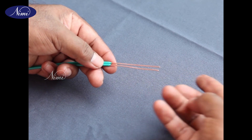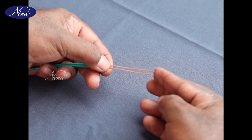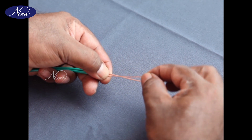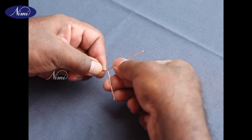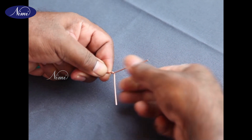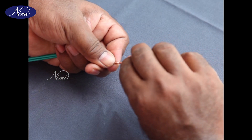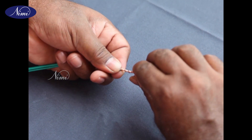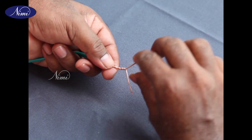Step 5: Cross the bare wires at an angle of 90 degrees at a distance of 45 millimeters from the cable end. Step 6: Tightly twist the ends. Remember, the twist on the wire should be uniform and close. Step 7: Make at least six twists.